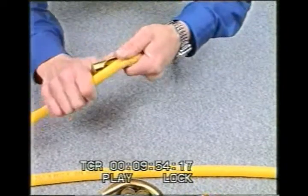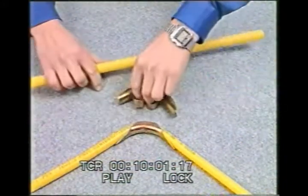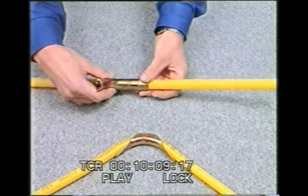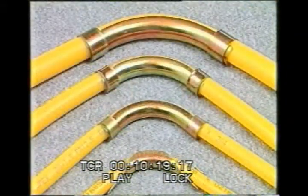As we've mentioned before, where piping changes direction, pipe linings can be used on the bends. We've already seen from the pictures how spiral or ring linings are fitted. Fitting a liner into a 32mm piping has to be done by two workers due to the physical demands of the task. The radius of the bend is also bigger, so in some cases it is better to use pressed bends with this profile.